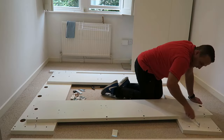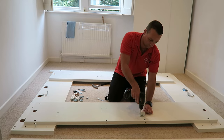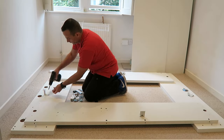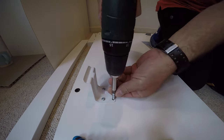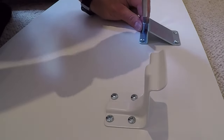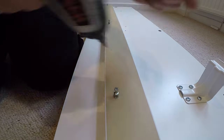Just don't go too deep — when you feel resistance, just stop. L-shaped brackets: secure them on the side panels and on the top and bottom panel. This is gonna hold the metal frame we just built — four screws for each L-shaped bracket. And the last one is a stopper, kind of a lock which will lock the metal frame when you put it down.